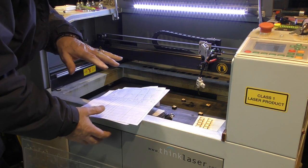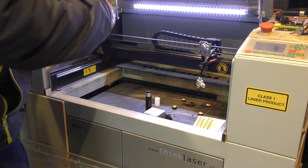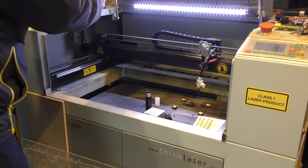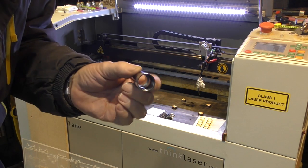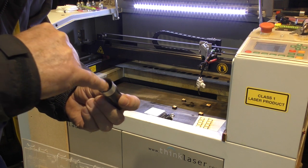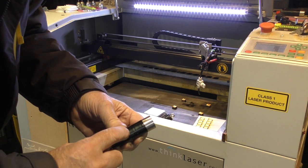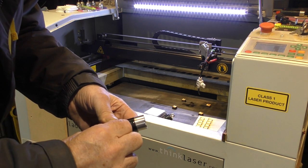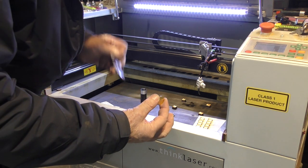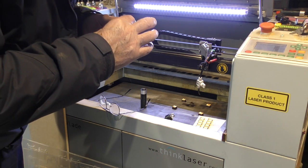Before I try that compound lens — which is two seven-and-a-half inch lenses — I'm going to try just one of them on its own to see what sort of performance a single lens has. I've made myself a special lens tube here, although it's a two-and-a-half inch lens tube to start with. I bored it out down the center so that the lens sits right down here, because that's where it needs to be when I put a pair of compound seven-and-a-half inch lenses in. Because this is such a long focal length lens, it looks almost flat, so I have to look into it to decide which is the flat side.